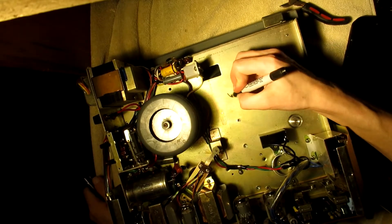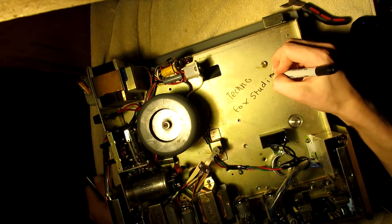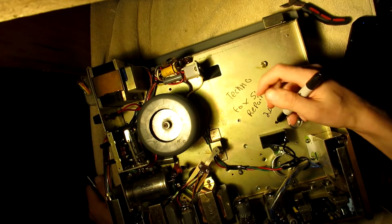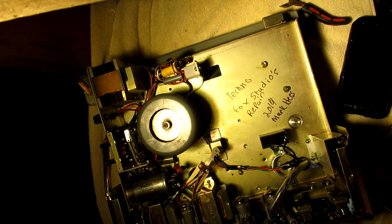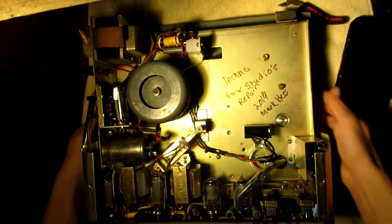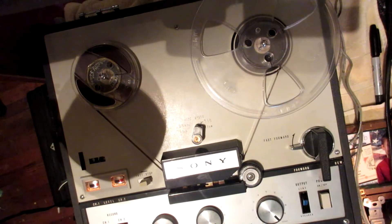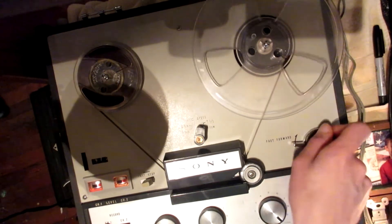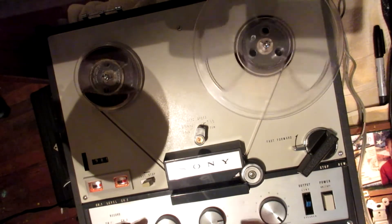Okay, let me clean up everything. Actually, before I go, let me just put my signature so people know when this was last repaired. Got the bulbs. The cap looks good, it tests fine — tests a little bit high, but it's a 60-year-old cap, you've just gotta let it go.